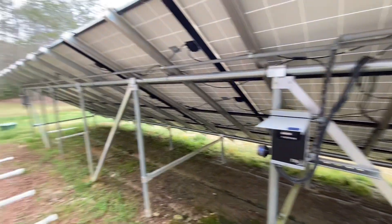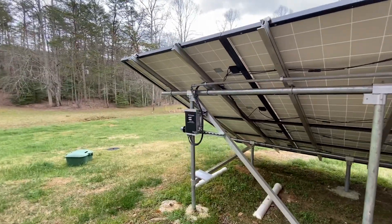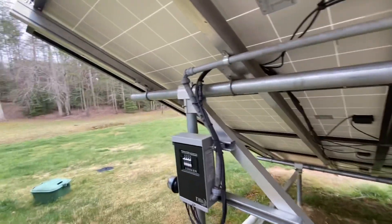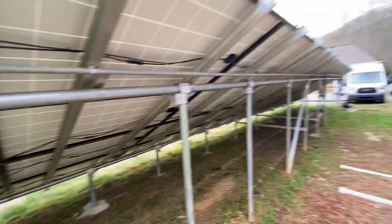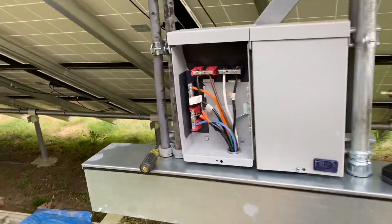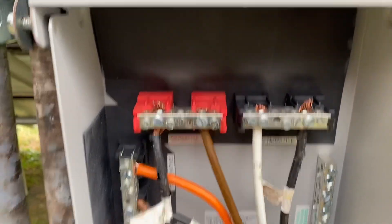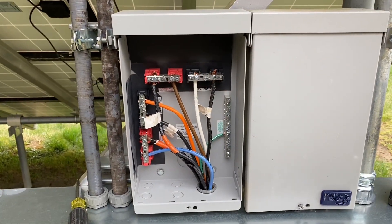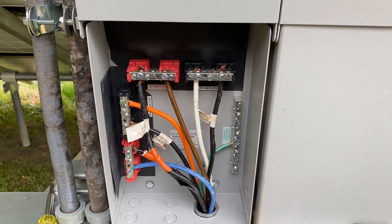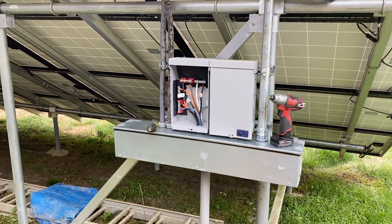I still have to come back and do something with these other two combiner boxes. This is kind of the old school way of doing battery backup — combiner boxes and lower-voltage charge controllers. He's paralleling three panel strings in these charge controllers and then heading back to his FlexMax charge controllers, which can take about 100 amps. I did want to show you guys this — it's a Midnight transition box. Really solid way to do a transition — it's got a bunch of bus bar terminals mounted in it. You don't see these a lot but I keep them on my truck.